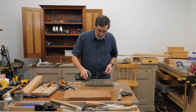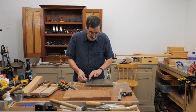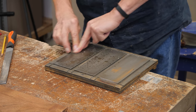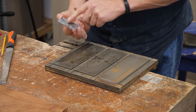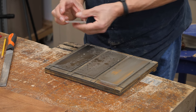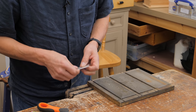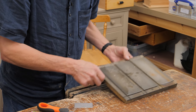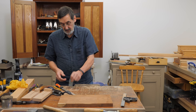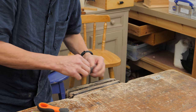Now I'm ready to just buff out and polish that burr off the other side. I've got a burr on this side — I can feel it. I've polished this out just a little bit because this face is already polished anyway. Now I don't have the burr here, but the burr is on that edge, so I've just got to wipe this — the burr will be removed when I burnish the edge.